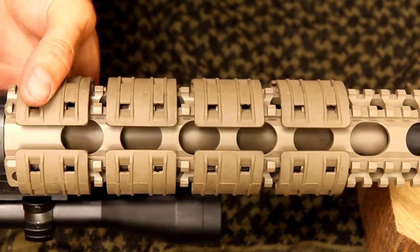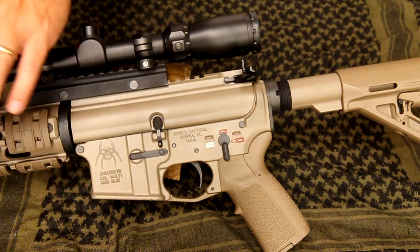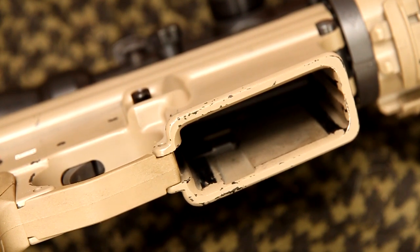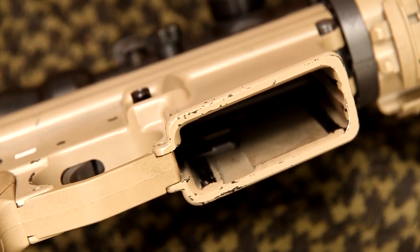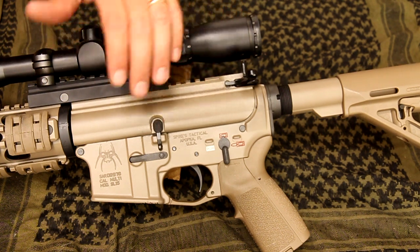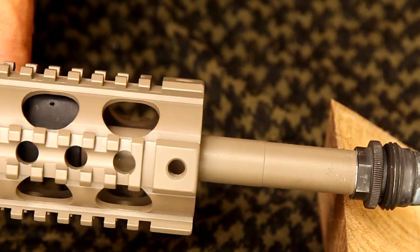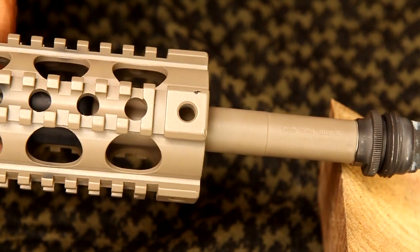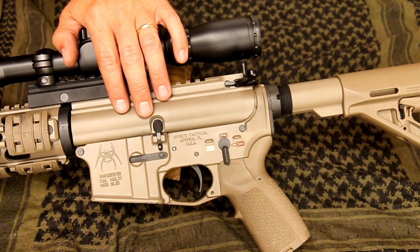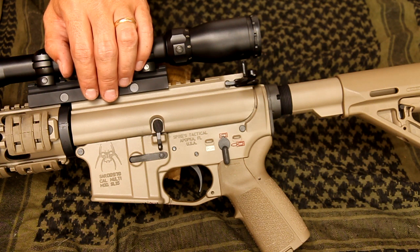On the other side of the receiver, this side is actually looking quite a bit better. There is a little bit of wear if you look again along the mag well, including the front of the mag well where it's been rested up against items — sometimes wood — to get a stable shooting position, so it's not too surprising that some of those places are wearing. Overall, I'm pretty pleased with Alumahide for the cost and the equipment requirement to set up — basically just buying a can and then taking the time to bake it to help it cure properly. Being my first experience, I probably could have done an extra attempt at degreasing and I don't know if that would help some of these smaller nicks, but it might have.